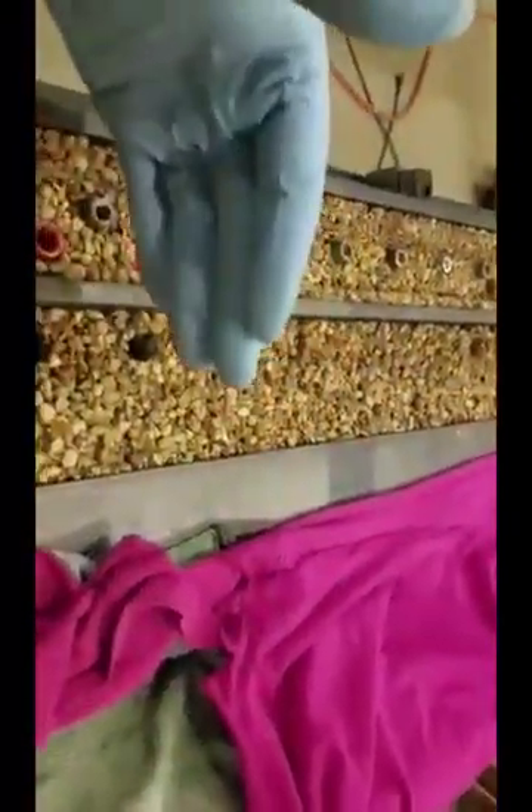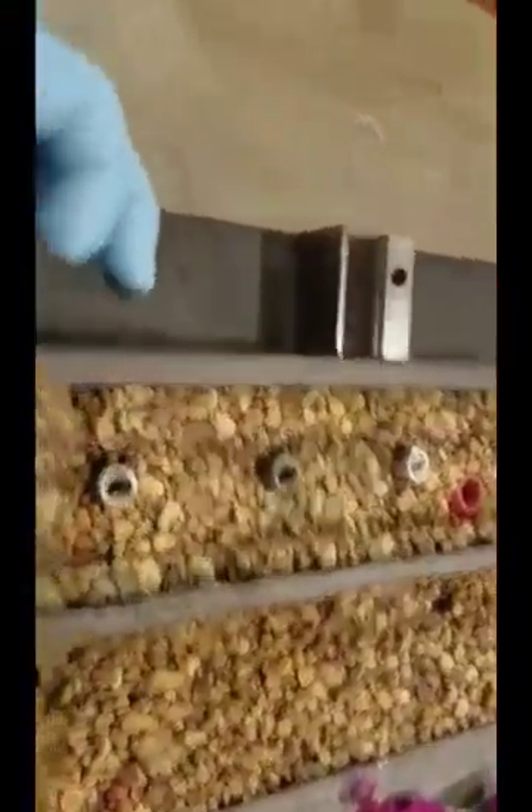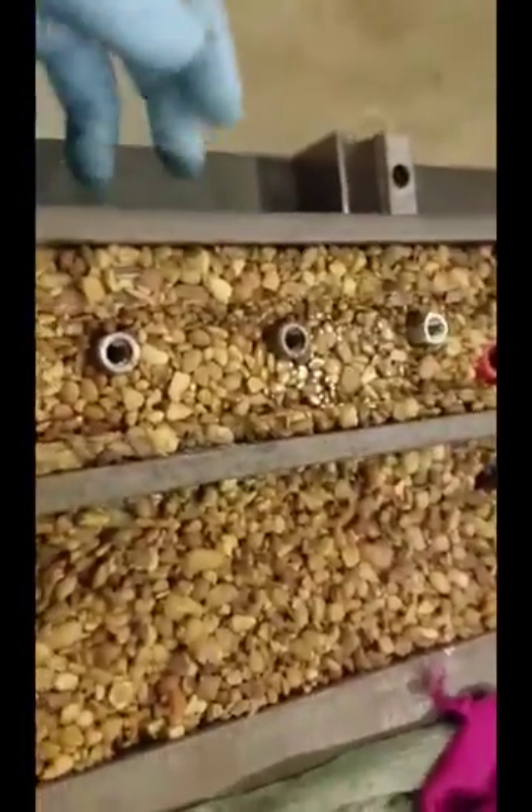I know I have the sensor on one corner — I could check all four corners, the middle, turn it over, get data points from different places. When we did the base over here, I had the transducer in the middle since the casting was upside down balanced on a 1-2-3 block. The middle seemed to be the best position. There are ribs running across every six inches, and between those ribs seemed to be the best place. There's also a rib running up the center for stability. But I can put the sensor pretty much anywhere on the casting, tap it, and get nothing.